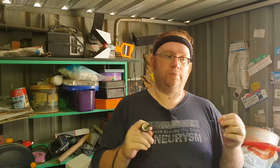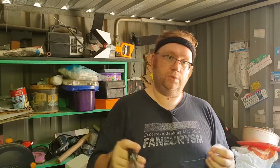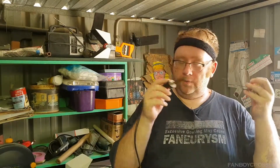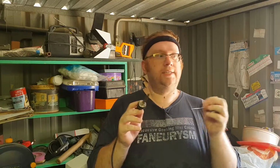And if you're not entirely sure, use a solder sucker, remove it, and then deal with it later. Allow the components time to cool down. It'll only take a few seconds. It's not going to take a lot of minutes, but while you're waiting for one, do another connection. Honestly, it's practice. I'm still not 100% confident sometimes on these things. I will go back and redo them. If the solder has moved on between 2 tracks, definitely wait for it to cool down, reheat them, and get a bit of solder sucker, whatever.